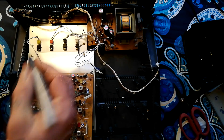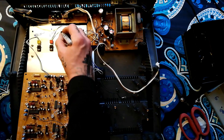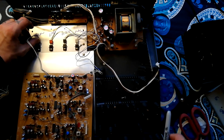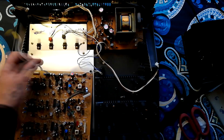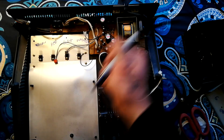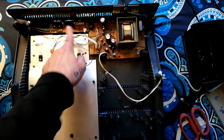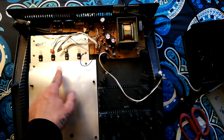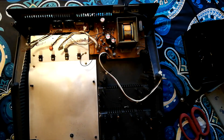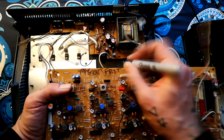You don't really want to disturb the heat paste, so the much easier thing to do is actually write 'yellow, red, black, and white' on the board, then disconnect those, saving the knowledge that you'll be able to connect them correctly on reassembly. At this point I'm going to write on this little daughter board 'before bottom' — I can envision myself screwing down all eight screws of the bottom board and then realizing I haven't put this back in. I'll also write on this board 'tape out first' with an exclamation mark.